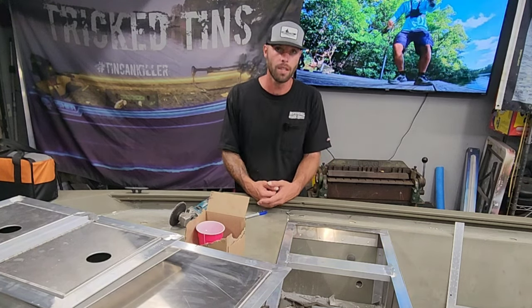But they dropped right in, shot some rivets into here. And then you can see over here, I put this little mark right there. That's basically just a Sharpie mark. That told me where this rib is, so I knew where to put these other rivets in here to hold this thing in tight. Now this whole compartment is not painted and it does bother me. So before I put all these hatches in here, I might end up painting this compartment too.